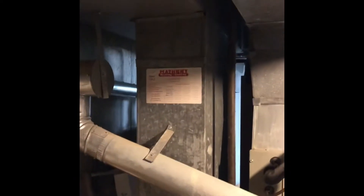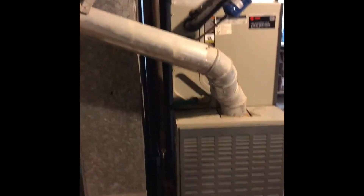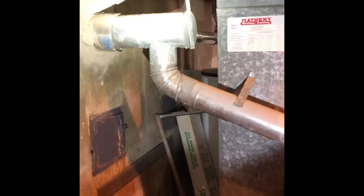I'll get some sizing on our return drop to see if we need to replace that. There is 5 inches of space between the return and the furnace, so we could slide a 5-inch Aprilaire media cabinet in there. Our flue pipe has already got a flue liner installed, so we'll just go from the flue tee back down into the new system — just bring six foot of four inch and three elbows, that should be more than enough.